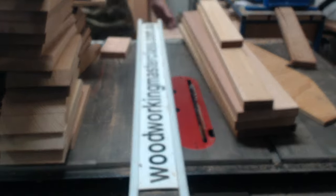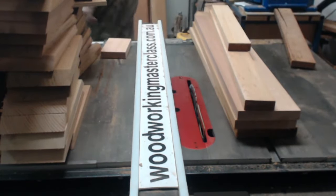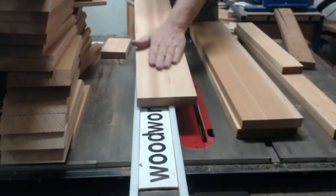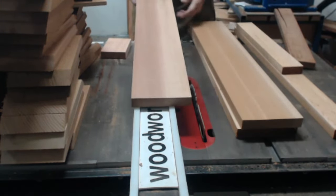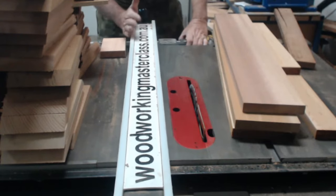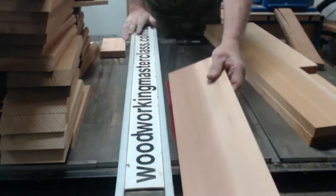Now I'm going to cut these just a fraction oversize. I couldn't tell you what 90 mil is in inches, so we're going to go metric on this one, but it's about 4.5 inches, I would say. What I've done with these is re-sawn them through the bandsaw, and I'm leaving the inside rough sawn because the bees like it, whereas humans like it smooth. I like the dark colour, so I'll keep it dark. I'm going to make this just a little bit over 90 mil, about 91 mil. That allows for a bit of cleanup if we need it.